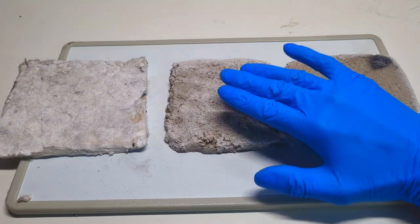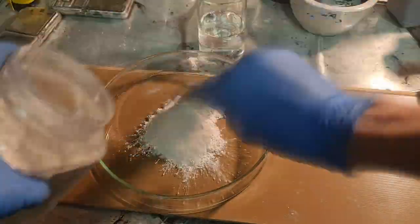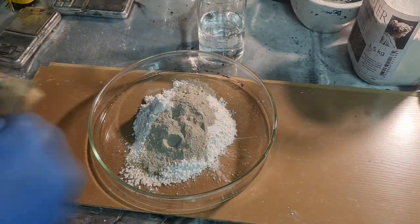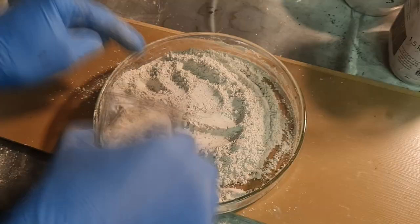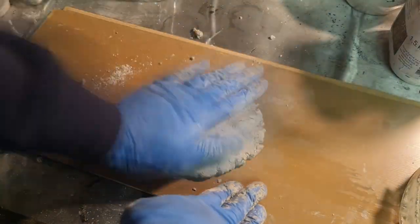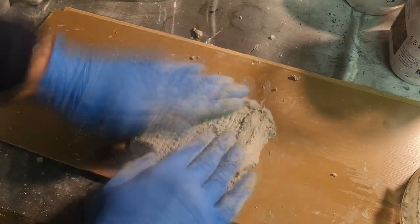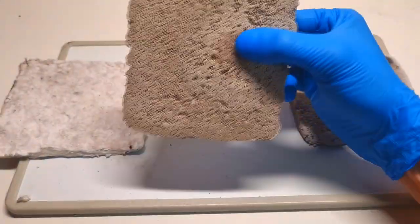In the second test, I made a brick from plaster of Paris, cement, sodium bicarbonate, and a little bit of water glass or sodium silicate. I also added some glass fiber mesh so the brick would not crack. The quantities to make this brick are 4 spoons of plaster of Paris, 2 spoons of cement, 1 and a half spoons of sodium bicarbonate, and around 10 to 20 milliliters of sodium silicate.